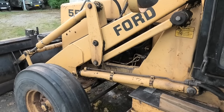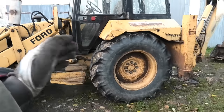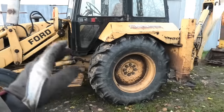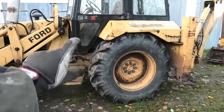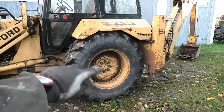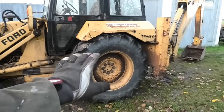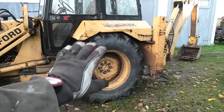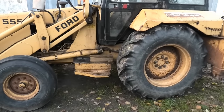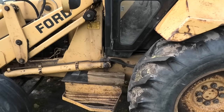So instead, let's go ahead and focus on the rear part of this, because we have two more separate oil systems here. There's a lot of oil systems in this machine. We have one up here that is for the torque converter and the gearbox, and we have one back here that is for the rear axle and differential and the brakes. This has so-called wet brakes, which means that the brakes are submerged in oil inside that rear axle, which is a pretty common thing for tractors. But let's start with this gear section, because we also have a filter on that.